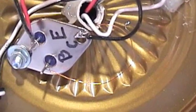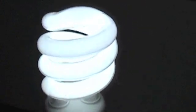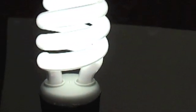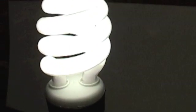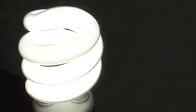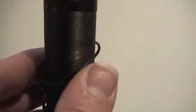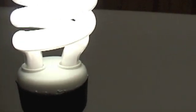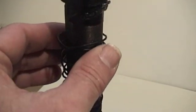I'll show it lit up - it's pretty bright. That makes a nice little light. You can adjust it by moving the coil down. It's drawing about 250 milliamps all the way up here. If you pull it down, you can have it draw down to about 200 milliamps. You can see it's brightening as I move it up, so that's about peak right up here.